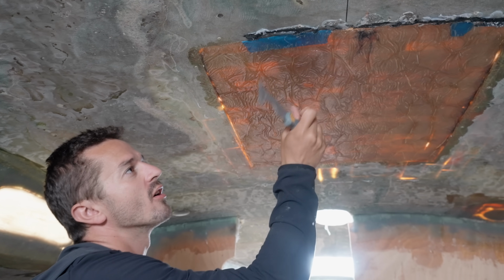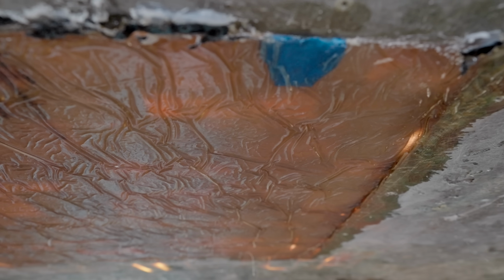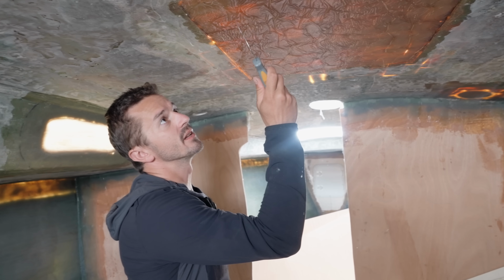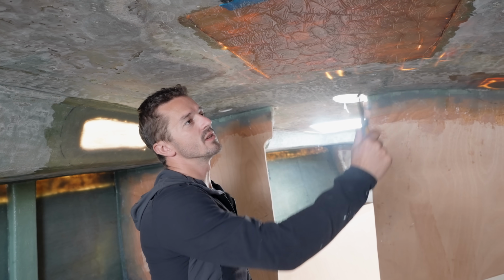The resin's hard, but there's always this sticky stuff that oozes out to the end. It's there, and once you pull the plastic off by this afternoon, it'll be just as hard as the other side. But again, the contour is perfect. And that's why I did so many layers of chop on the bottom, to fill up that gap, which means we can grind this down smooth again.